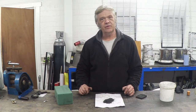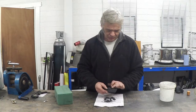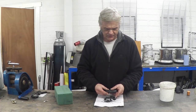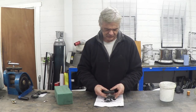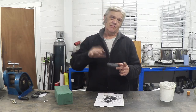All you actually do now is put that on top of there. What I'm laughing at is how stupidly easy this is — put that on top, flatten it down a little bit so it adheres. You don't want to really crush it, but you do want to flatten it a bit so it adheres to the foam. And we get a two-layer structure where we've got our carbon foam and our slightly crushed exfoliated graphite on the top — and that's it.